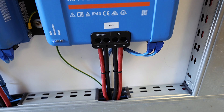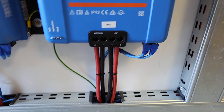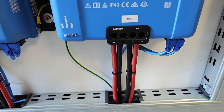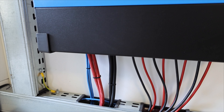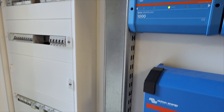Regarding the cables, I decided to use very thick cable — 50 mm² for PV because I have three strings connected in parallel. It's oversized, but I like how it looks. For the battery cables I have 50 mm² as well, and this is mandatory — not just for appearance but defined correctly so that they don't become very hot when delivering energy to the batteries. Each MPPT delivers energy through the metal gutter, and for the 450 MPPT I put two cables of around 50 mm² each.